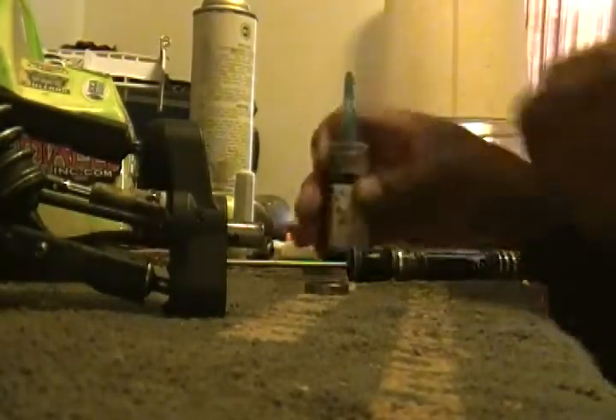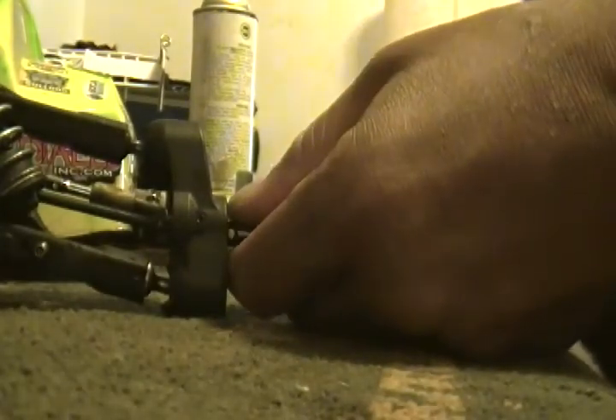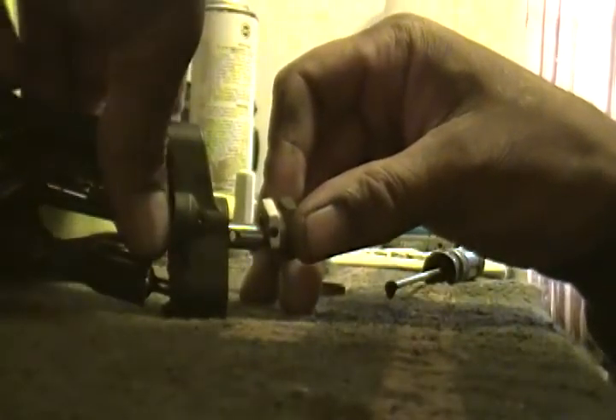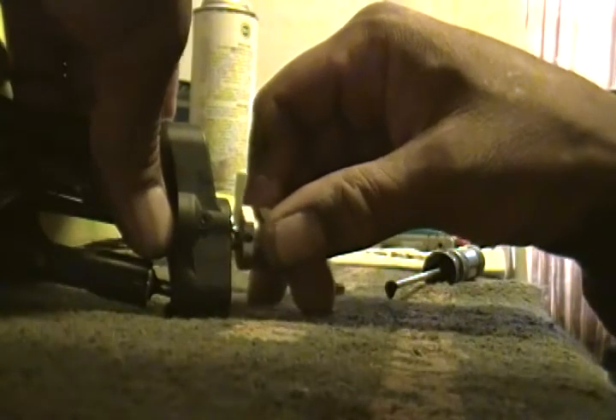With this you get to that little hinge — you can't go any farther, simple as that. Now over here to the grub screw — put a little Loctite on there, just a little dot. We're going to take the hub, line up the hole on the hub to the hole on the axle, and go sideways so my pin won't fall out at all.